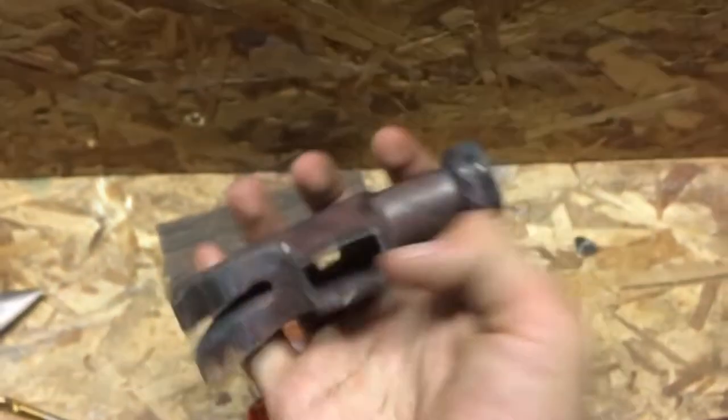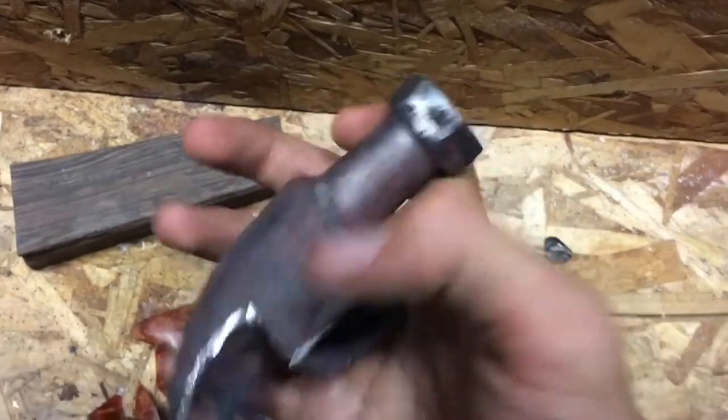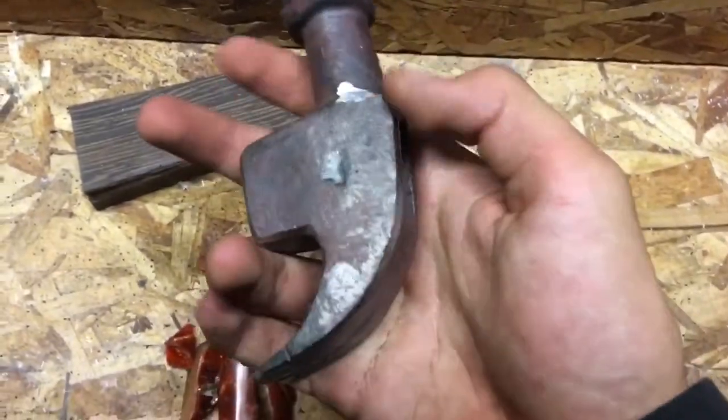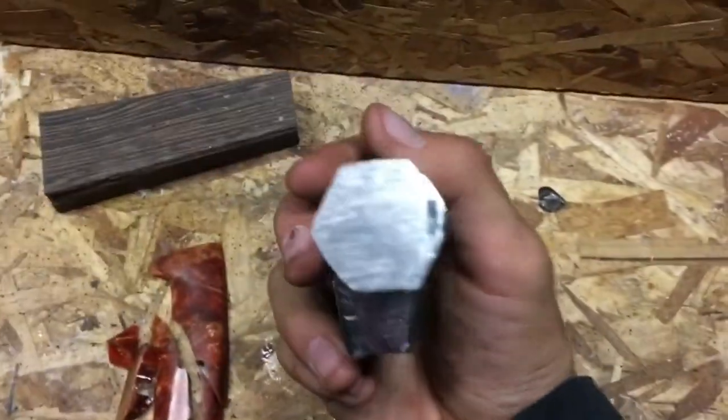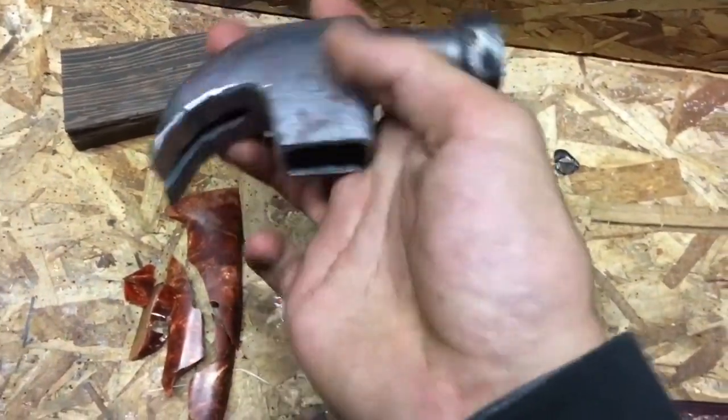I'm done forging out the profile. I added a hexagonal shape to the front of it just to add some flare. I'm gonna go ahead and profile it on the grinder a bit — it's getting dark so I'm not going to show that — but then I'll quench it and throw it in the tempering oven for the night. I mostly just flattened out the face and added a lot of bevels, just kind of wherever there was a flat edge, to once again spice it up. I'm just experimenting with the design and it's a lot of fun.